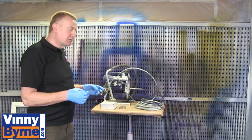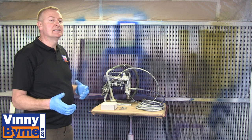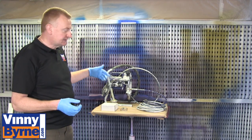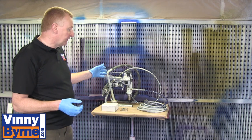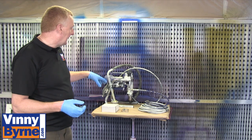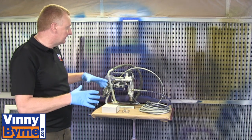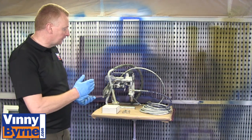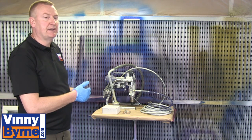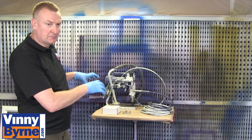This can be very important if you're doing fine work or if you're using two component paints where the paint is quite expensive. When you change it to a gravity feed you're going to use slightly less energy to work it. You can also see how much paint is in the hopper. By installing a gauge we can fine tune it down — for fairly big jobs you can work out how much pressure you need and calculate how much paint you're going to use for the entire job. So it can make your machine a little bit more intelligent.